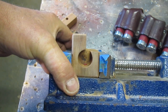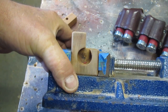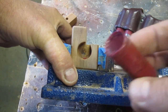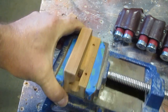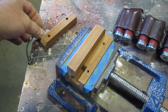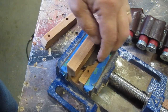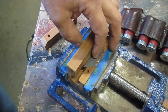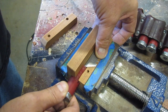The blade has to come in just enough to get inside the shell and roll the crimp like this. And if it's too far over, it won't work. And if it's too far to the side, it won't work. When I'm making these, I know how I have to get it, but there are quite a few little details you probably won't be able to see. Basically, I just check it by inserting the shell, and this will show you the operation of how it works.